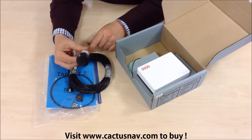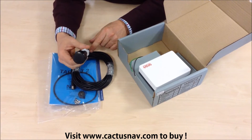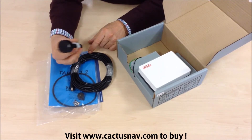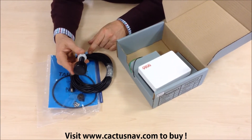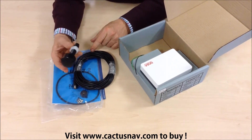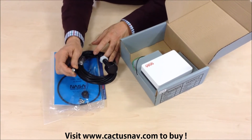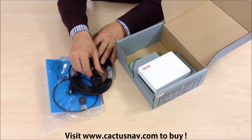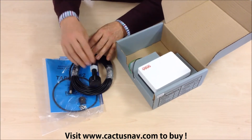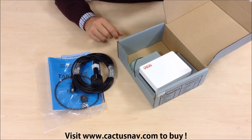This is a 150kHz transducer unit. It's one of the few that is still compatible with the old Seafarer type echo sounders — it even has the same plug. So if you're upgrading from that, you can use the existing Seafarer transducer, and then when that eventually wears out you can fit the new one that's supplied.